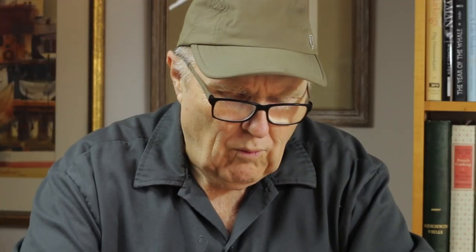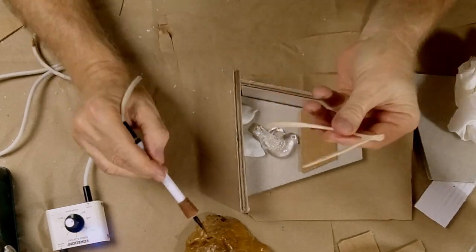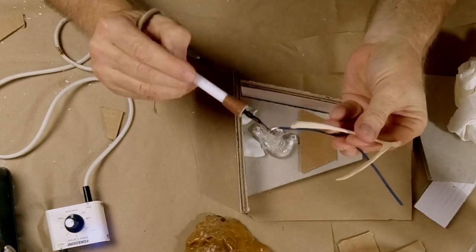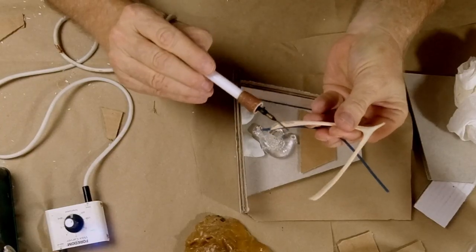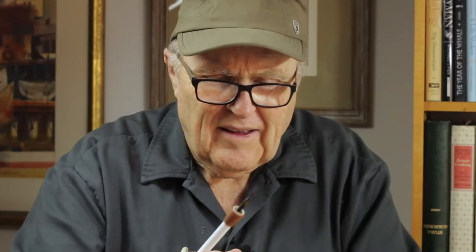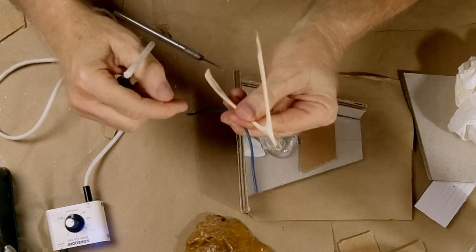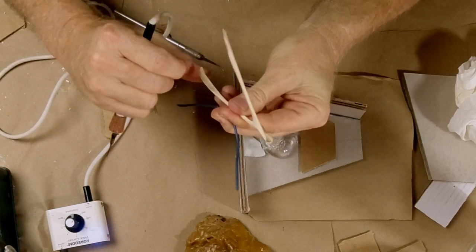The modifications I'm going to make to the bone are simple — I'm just going to come into the roughest parts and give them a light coating of wax, just coating those rough areas lightly. I'm really heating the wax so it fills in and runs into those cracks nicely. That little bit of wax filling those holes is going to make a difference and help prevent too much porosity at the end.